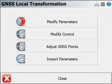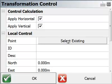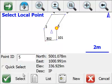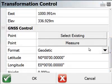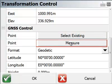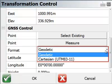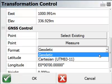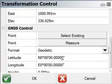When I pick OK, I have the option to modify the control. I'm going to add a new control point and select point five. Moving further down the list, I have additional options for setting the GPS measurement. I can select an existing point that's already been stored, pick the Measure button to trigger a GPS shot, or I can manually enter either geodetic lat/long values or Cartesian — in this case UTM83 — values. Here I'll set Geodetic and manually enter my latitude and longitude.